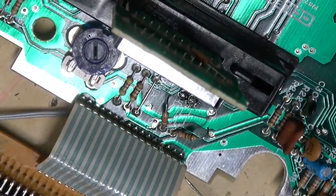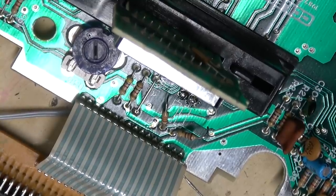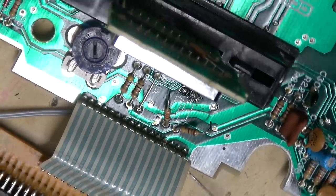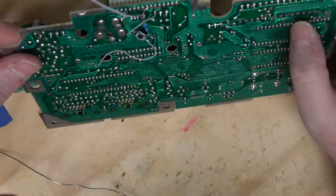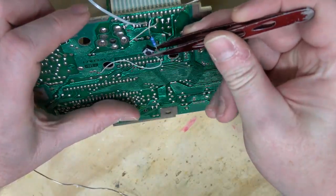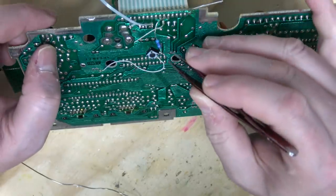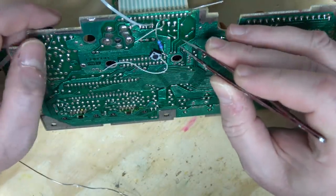I could see them using the positive 12 or something with their video chip, especially since they use the LM1889 component video to composite video converter chip, which was actually also used in the ZX Spectrum. But what in the bleeding heck is this negative five hooked up to?